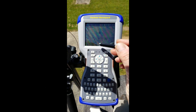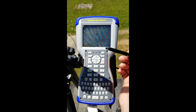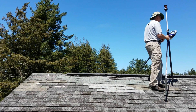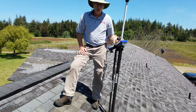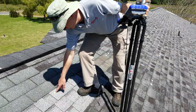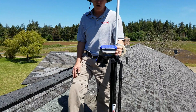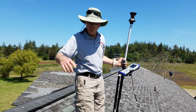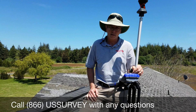After following the direction of the data collector screen, I've nailed down to the point within five to eight thousandths of a foot in both directions, which is totally close enough. So we're going to go ahead and stake this point. Now we've used the system to stake out a number of points here on the roof, with a little piece of tape and an X marking the precise spot, and then we put the point number on the piece of tape as well so that we can refer back to that as we're actually installing the hardware — we know what point on the map we're dealing with. This whole roof could be laid out, covered with panels, with four mounting points for each panel, in probably about an hour. And that is the productivity of a robotic total station.